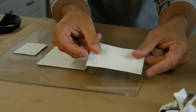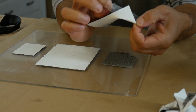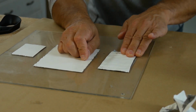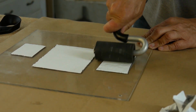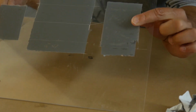At this point, if you're just going to reapply some more tape, you can just put new Eternabond tape on top of that, and that gray sticky material will rebond to the old material, and it'll create a nice waterproof seal again. So there's no need to remove the sticky stuff if you're just going to reapply some new Eternabond tape.